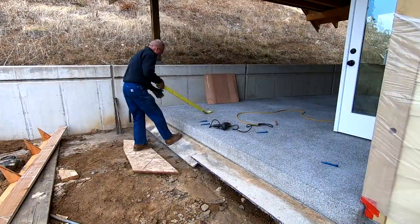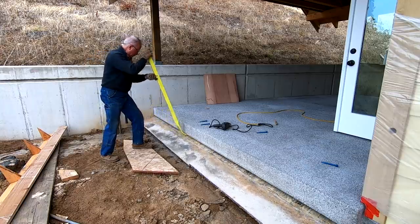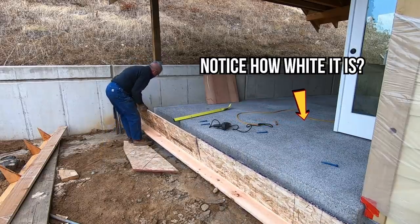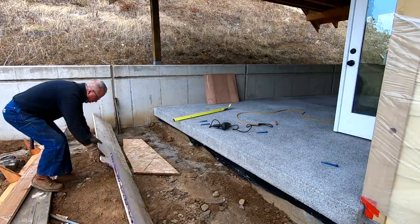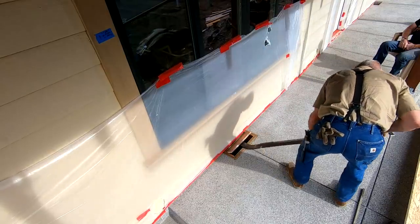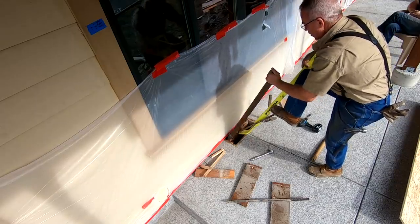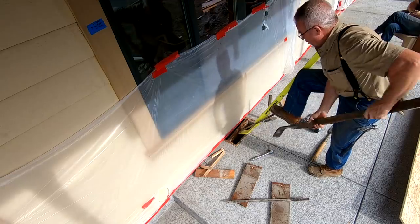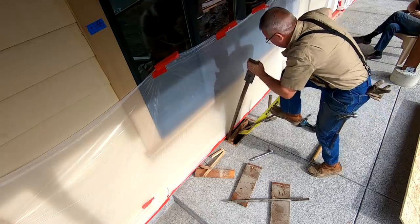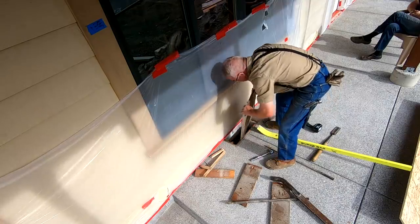One of the things that is happening while you wait, and as the concrete is getting harder, is that calcium salts are migrating to the surface of the concrete with the water vapor that's finding its way out. This is what gives the concrete a whitish, chalky color, and in extreme cases, it's what is known as efflorescence. In our situation, on exposed aggregate concrete, it obscures the beauty of the rocks and needs to be completely done generating and migrating to the surface before you remove it.